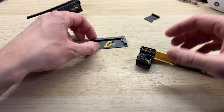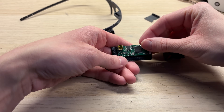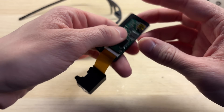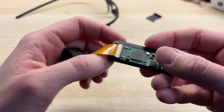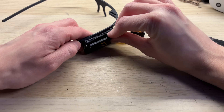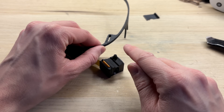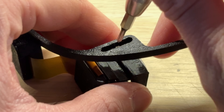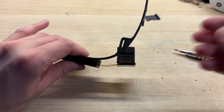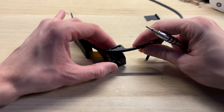After installing the Pico, it's time to install the driver board. For this step, you will need the plastic cover, which basically works as a driver board holder. You simply push the driver board on top of this small plastic tower and when you have it in the correct position, you melt the plastic tower from above. The plastic tower will hold the driver board in place and make sure it stays in the correct position. Now you can install the driver board inside the plastic frame, and then mount the micro display on top. This can be easily done with a single self-tapping screw. You mount the display housing by putting a single self-tapping screw through the headband ridge and then screwing it into the display housing. You can leave it loose for now as you may want to adjust the viewing angle, but if it feels right just tighten it with a screwdriver.